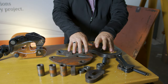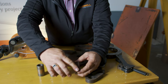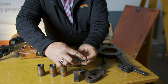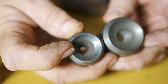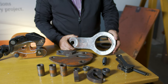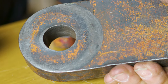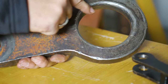Let's talk about dull teeth. As you can see, the light reflects back at you, and it's obvious that this is a worn tooth. That can cause the clamp to slip when it's trying to engage the plate. Here's an example of a sharp, clean tooth — that's a good tooth compared to the dull one. I also have examples of chipped teeth. Here are a couple of shackles that have shown severe wear in the shackle eye area — they exceeded 10% wear and were rejected. You'll also notice the hole was elongated, which is a sign of wear or overloading. In both cases, the shackle should be rejected and replaced.